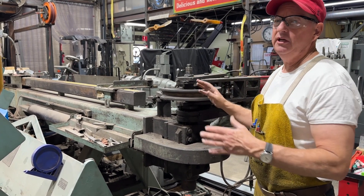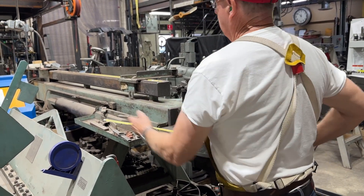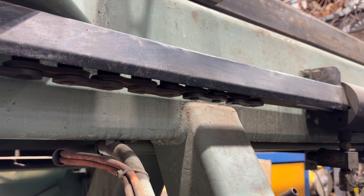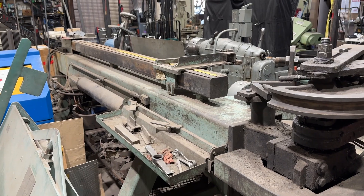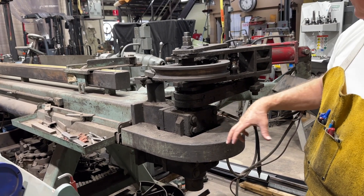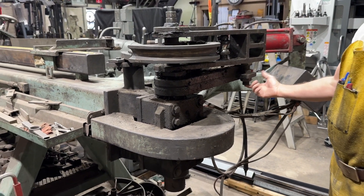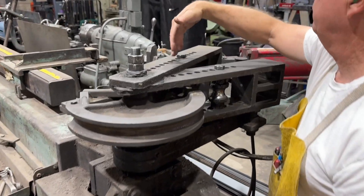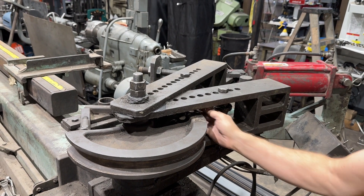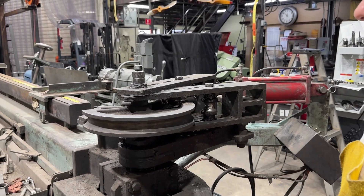It's based loosely on a pipe bender where you have a very long body, and then there are two hydraulic cylinders, one on each side, that drive a chain. The chain is connected to a sprocket underneath here, which is welded to a three and a half inch chromoly rod, which is welded to this arm. This is essentially the main frame, which is activated by a pneumatic cylinder to open and close the capture die back here.